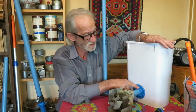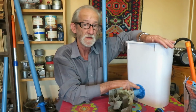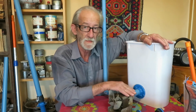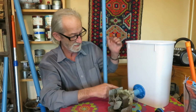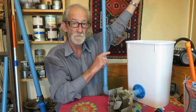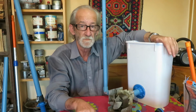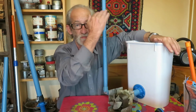With this information, the amount of liters of water and the time it took in removing all that water, we can define the amount of liters or gallons per minute of the pump. That gives us an idea of how good the pump is. Also, if the pump is capable of removing all the water above 1 meter, it should be more than enough for what we need, at least for this project. Maybe in your project you'll have to do something different, but in this one we need just 1 meter high.